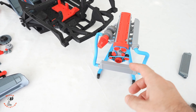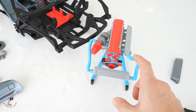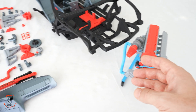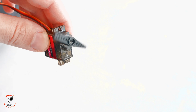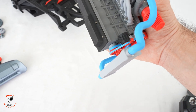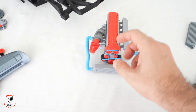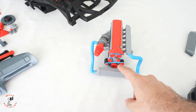I had to order some small bearings and do some testing, because I didn't want to put any motor over there that would stop us from twisting the pulleys and cause problems. I was thinking to put a servo — with metal gears it will overcome the resistance of the belts with no problem twisting. But with a servo you have a problem: it's either 360 or 90 degrees and then it stops. So I was thinking to make it continuous rotation, hide the servo inside the block with only the wires coming out, using a 9-gram servo which has decent torque. Let's get into SketchUp and do the designing of the block and redesign the pulleys for the bearing.